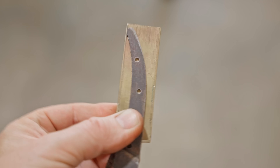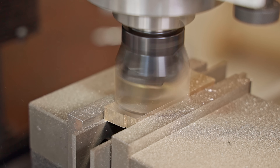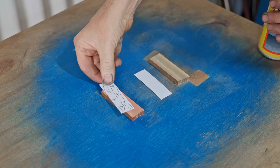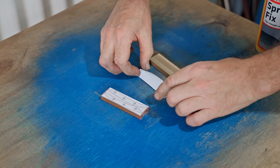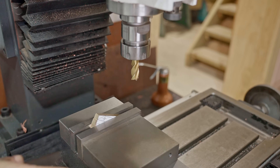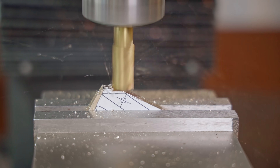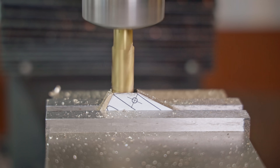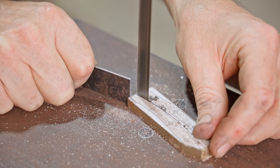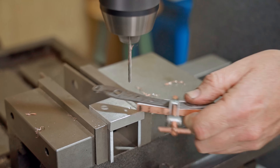For the handle infills I'll use brass and copper. Using the face mill I'll mill them down to the correct thickness, which is the same as the jaws. I was going to use just brass but I didn't have enough without milling down a piece that was far too big. The infill pieces have a bevel on the end which I'll mill first while there's a flat part of the bar to reference off, then I'll cut the rest out on the bandsaw. I'm going to try mixing up the infills by using one brass and one copper on each pair of pliers — let me know what you think.